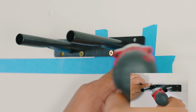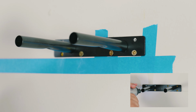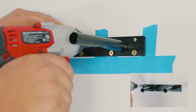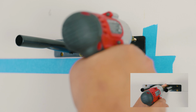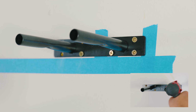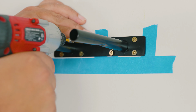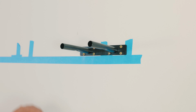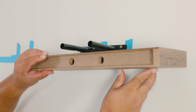anchors. In our case, we're going to screw the screws looking inward to the stud. Once we feel the first grab, that should be enough. You don't want to turn extra to over tighten or to make the anchor move on its place and lose its grip.